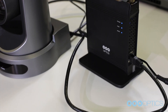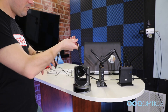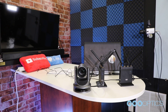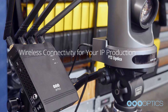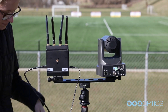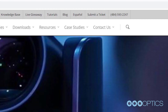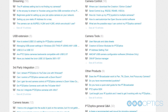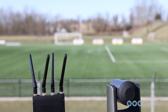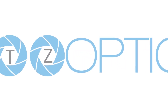Daisy chain mode will reduce transmission bandwidth, and level 3 cascading is recommended. All device IP and MAC address information are in the configuration networking web page. A network configuration tool is included for configuring your base units during setup and for troubleshooting. If you have any questions during the setup of your wireless cable, feel free to reach out to our support team at the phone number listed on ptzoptics.com. You can also review frequently asked questions on our knowledge base at help.ptzoptics.com. Enjoy! PTZOptics — where broadcast quality is made affordable.